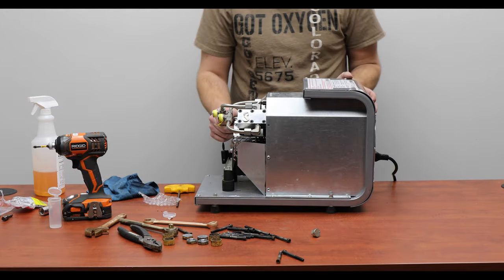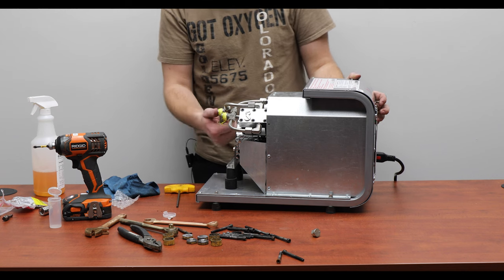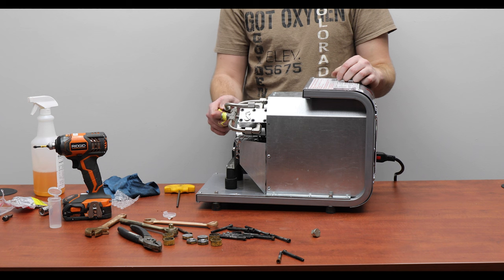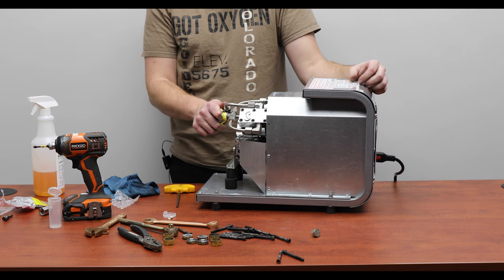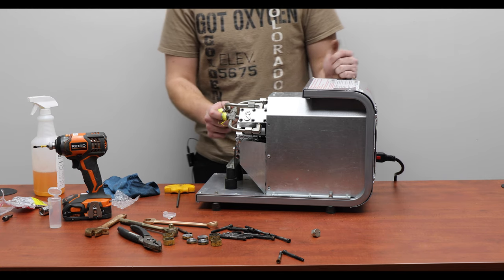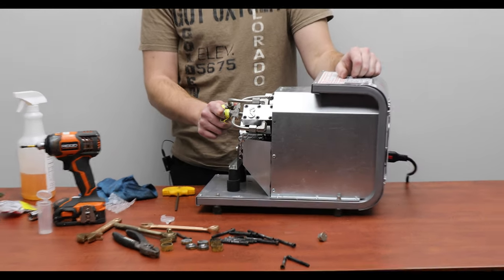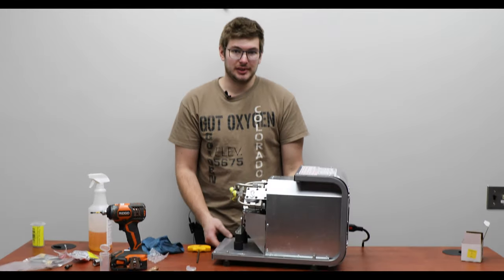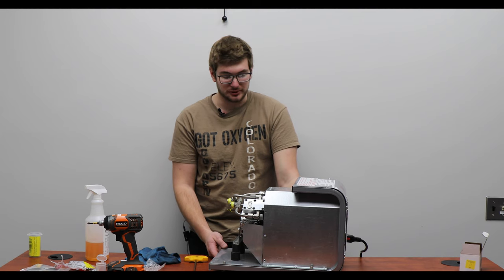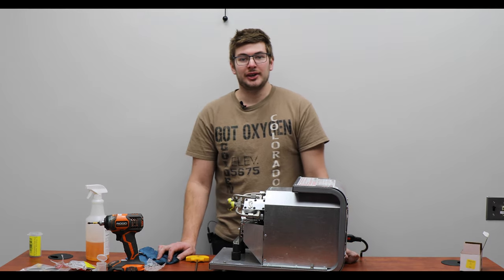I'll give this pump one final test after the sheeting's on. I can already feel the suction is much better than it was before — a lot of the leaks have been eliminated. You might hear it be a little louder at first, just because all those leaks are gone and a lot more air is going to be passing through. That's all I have for today. This took me about 25–30 minutes. If it's your first time doing the rebuild, maybe budget 45 minutes to an hour, but it's really not that hard and it's something you can do by yourself. If you don't feel comfortable doing this, you can always send it back to us — we have all the parts on hand and can get it turned around pretty quick. Thanks for watching.